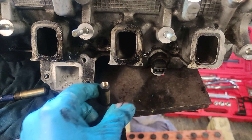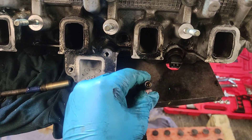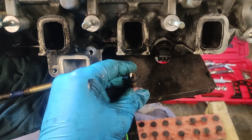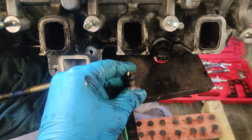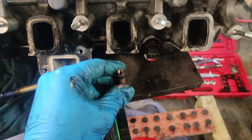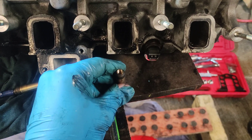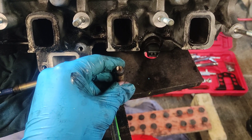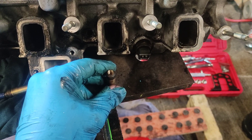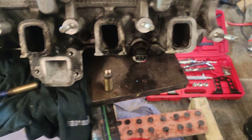What I've done, as a couple I've done earlier, is I've tapped them. Before you tap them you've got to drill them out with a 6.8mm drill bit. Don't do 6.5mm, don't do 7mm, it's got to be 6.8mm. Because if you do 6.5mm then your tap's going to have a hard time cutting the threads and you might snap it. So you don't want to do that.